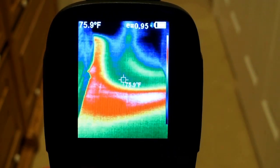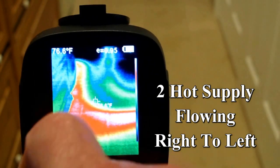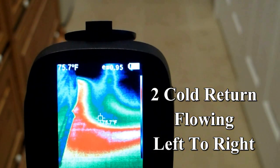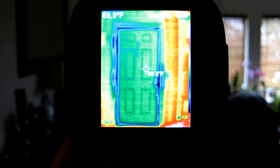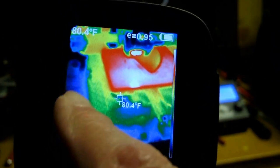This is the hallway in my house and I have radiant heat pipes in the floor. I can see where the hot water is going out into the floor and then the cold water returns. You can go around your house and look at the door — turn on the thermal image and we can see that the door is cooler than the surrounding area. This door is quite thin, so it's warm inside and cold outside. All around the edges of the door — the hinges, the door lock — they're the coldest, and the floor is the warmest because of the radiant heat. Looking at my 3D printer, you can see the build plate and the item being printed is heated by the build plate, and the top of the workbench is being warmed by the radiated heat.